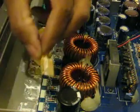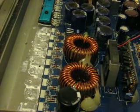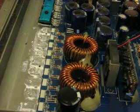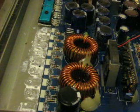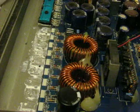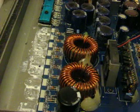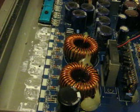This one also has this little piece of thermal tape material between the heatsink and the components. I'm going to take it off and clean it up too. This thermal compound removing solution is a two-step process. The first stage emulsifies the compound, and the second stage is a cleaner that cleans the metal and preps it for the compound.